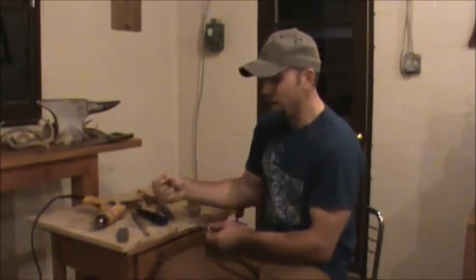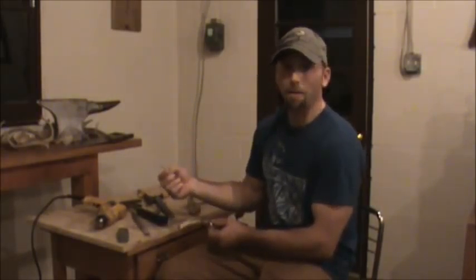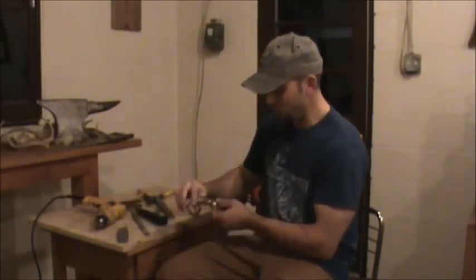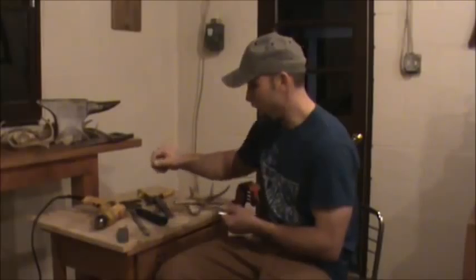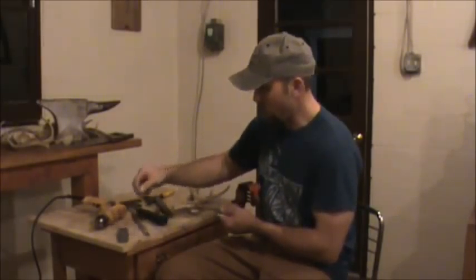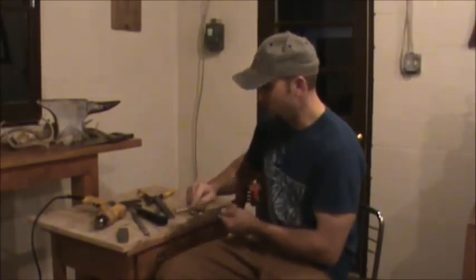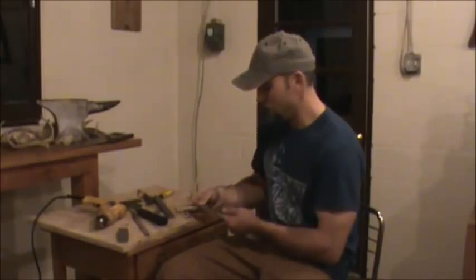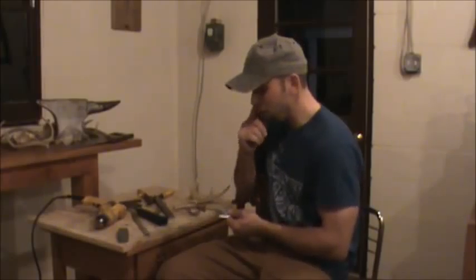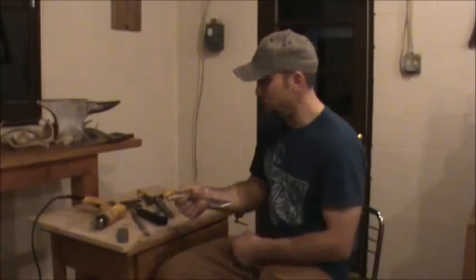And all I used was wire. That's what we're using. We're using stuff we have. We're not going out to buy stuff. We're making stuff like brand new from the stuff we have. I just took this wire down them holes, pounded it in, pounded it flat on the one side, and bent it over, and filed it down on each side once they're both flattened. And it holds good just like a rivet. You can use copper wire if you're doing a fancier knife. This is just to get the job done.